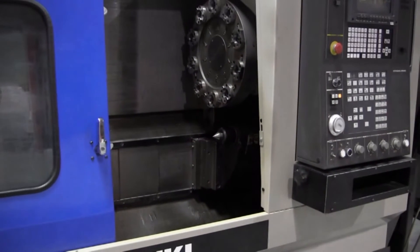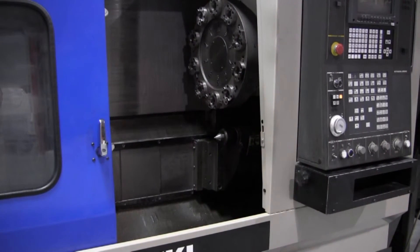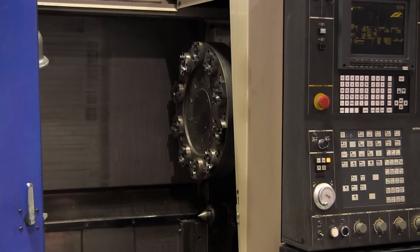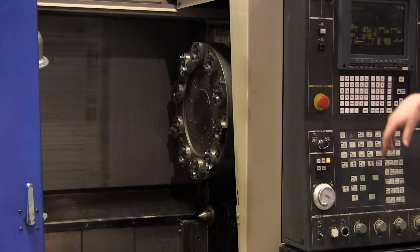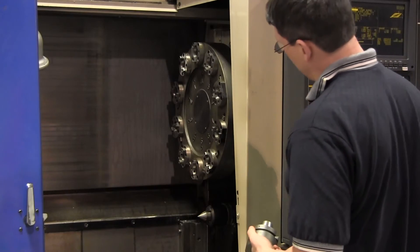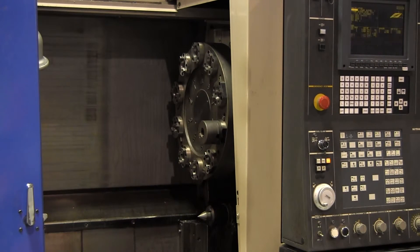No issues once you put a real load on it, but seems to be fine. If you need another one, you can get them from anywhere, or we do have an OEM brand new Hitachi unit in stock if you require it. Since you said you've never had a KV machine, I thought I'd show you quickly how the KV clamper works and how easy it is to use. On the control here I'm just going to hit jog — hydraulics are activated that way — go on clamp, clamp. That's it, you're done. Touch off your tool on the tool pre-setter and away you go.